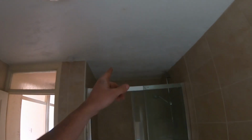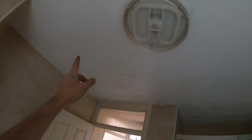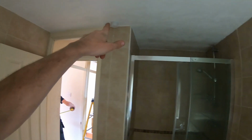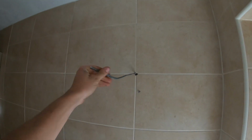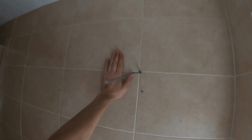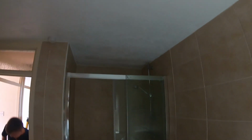So now's the bathroom one. This is a bit of a funny angle one. I definitely want one in the shower cubicle, and I think we're just going to stick the two here and here. Adam's going to be relocating the switch outside. We put a mirror feed in originally when we did the kitchen, so we just fed it down the wall, on the stud wall. Like I said earlier, these aren't getting replaced, so that'll be permanently live. And then another Wago box up here. So I'm going to take the switch down, mark out in the ceiling, do some cuts, same as I've done next door, and I'll just show you after.